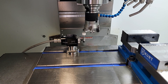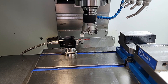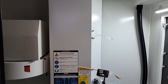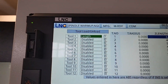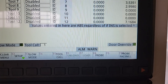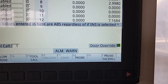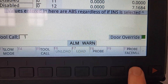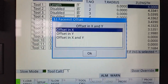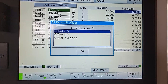Here we are at the last step — probing a shell mill. I'm using a Haas 2N shell mill and I've lined up one of the carbide teeth with the tool setter. I shut the door and go back to the probing screen. I have one selected for the length, and I'm going to press the 'probe face mill' button. It will come up with a prompt asking if you want to offset your shell mill in X, Y, or X and Y. I'm going to offset it in X, so I press input.